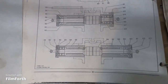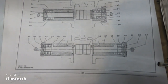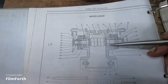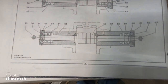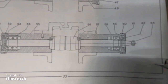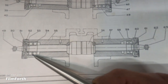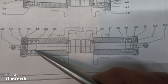It's really nice to have diagrams. This here is the Cincinnati — it's a neat spindle design. Here's the standard work head, and in the same casting you can add an extension spindle or have two extension spindles. On this side here are two separate angular contact ball bearings, likely mounted back to back.